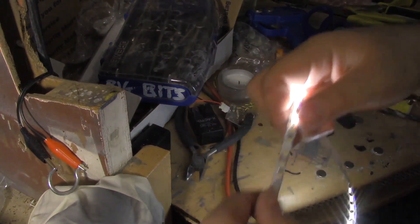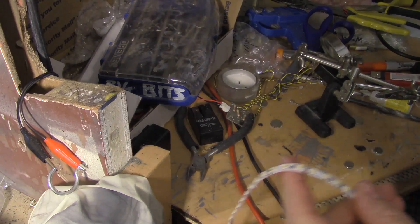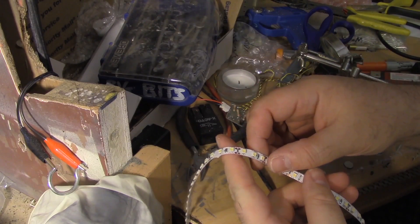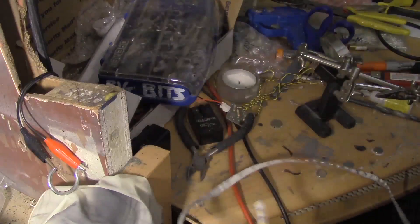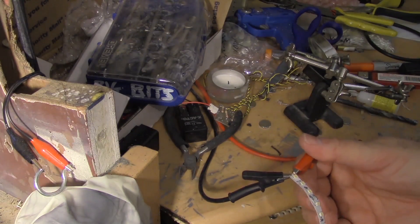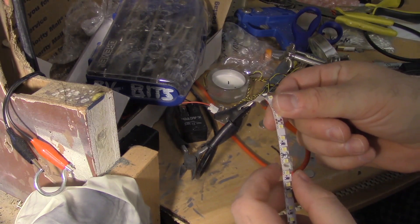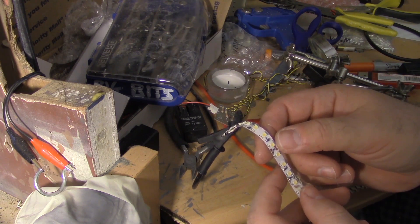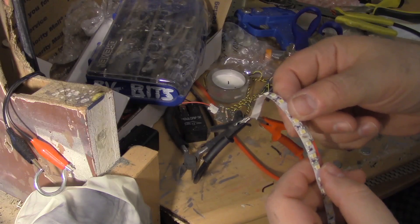So I've got a break right here, and I can see where I cut way too low. Let's try it from the other end and see if there's another break in there — and yes, there's one right away. I can see right where I cut down too far. Don't stray inside these bracket lines when you're cutting; that means you've gone too close. And it happens to be the same area where I jumpered the last one.